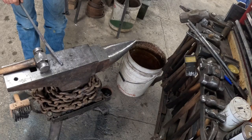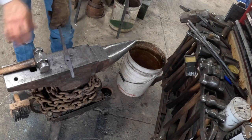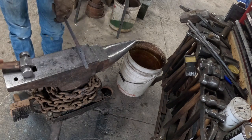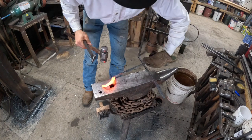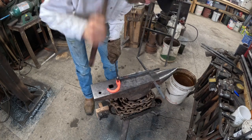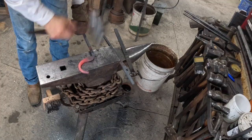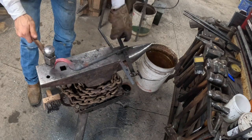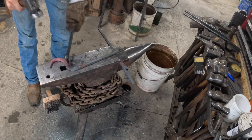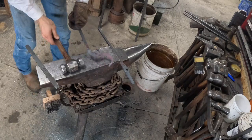That's why I don't drill them, because hot punching removes so little, and drilling is going to take a whole bunch out. So now if I wanna re-rivet these someday, I'll have something to work with. Right where I want to be. Although this one cooled off just a little too much on me, so I'm going to throw it back in.